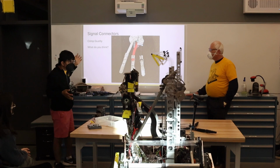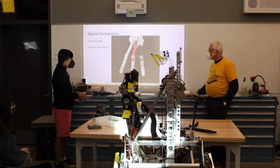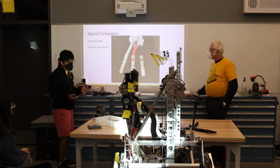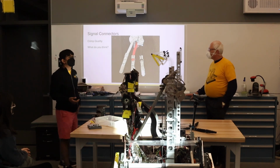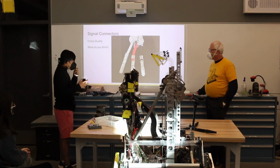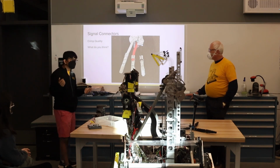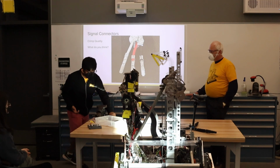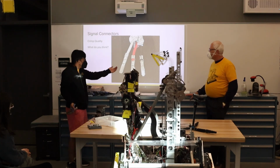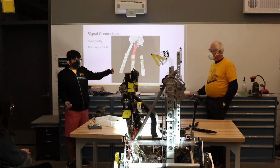Another common issue that I've seen is sometimes your crimper just doesn't work well, and you've gone one gauge up, or one size too large, when the crimper doesn't crimp down all the way. Sometimes multiple crimpers can do that. Like for example, this has two. You can go one size up, and then you don't have enough of the crimp going down. That would cause it to be too loose.